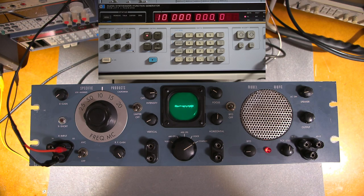I'm going to adjust this and put it out one cycle per second — so it's only going to be out one hertz. Listen to what happens. Here's two cycles. Put it back down to one. That's right at 10 megahertz. Let's go right to the last zero and put it out 0.1 hertz.